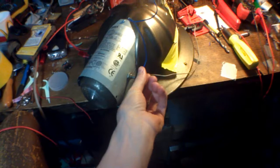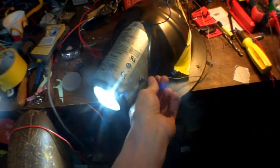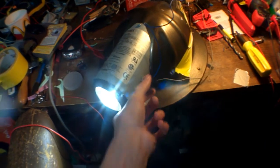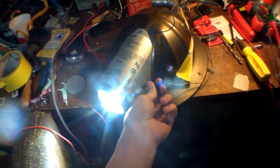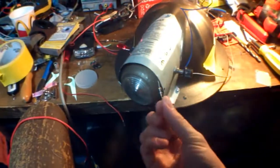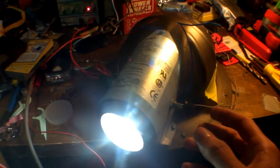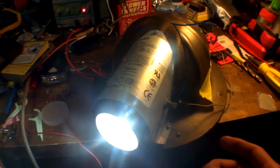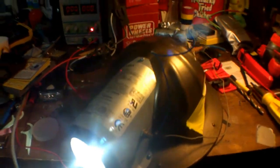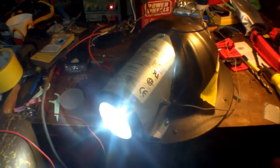So you have your basic controls — turning it on and max. The amount of rotation it takes to turn from lowest to highest is really small, but oh well. I can make the light brighter by adding another resistor to it. And since it only pulls about 250 milliamps on the maximum setting, that would be four hours per amp hour. Since this is a four amp-hour pack, that would be 16 hours of run time.